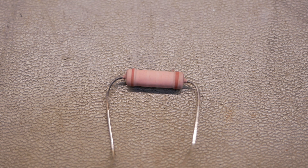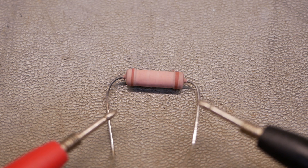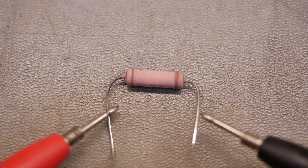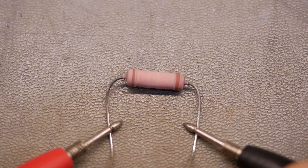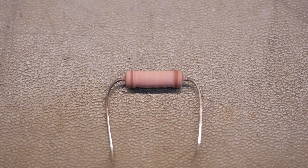Here's the 3W that didn't actually go open circuit at all, because our power supply sort of fell over in the supply current there. Let's just see what its resistance is now, because you can see during the process of heating it up, the current was dropping and the voltage was pretty well constant. That's what happens when a resistor drifts up in value, and now we're sitting at 105, so it's drifted a little bit.